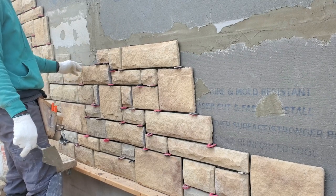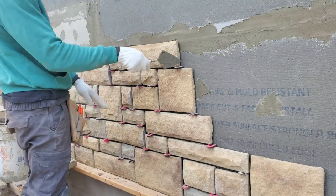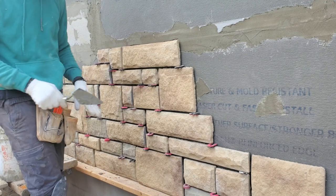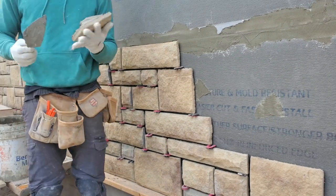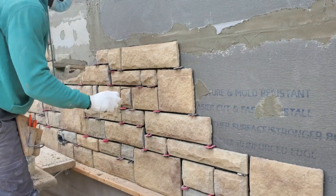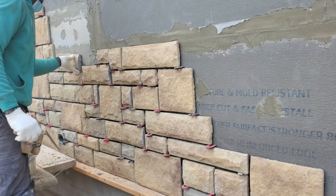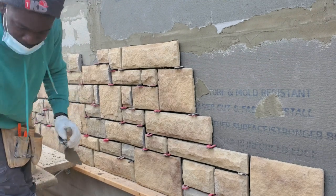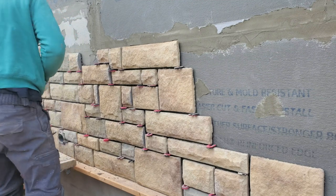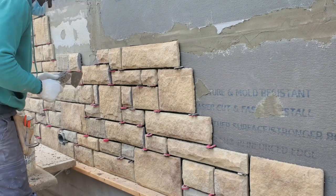So now right here — as I told you, once you have a medium and a small between each other, it's a medium over here and a small over there to bring it up to the same height. I'm going to put a medium here and fill with a small, then put a small to break this line so it doesn't go beyond the allowed length. One thing I want you to take away from this video: your bed joint is not supposed to be longer than four feet, and your head joint is not supposed to be longer than the biggest size stone — which in my case is this one. Once you reach that height you have to break it. That's probably one of the most important things in laying stone.